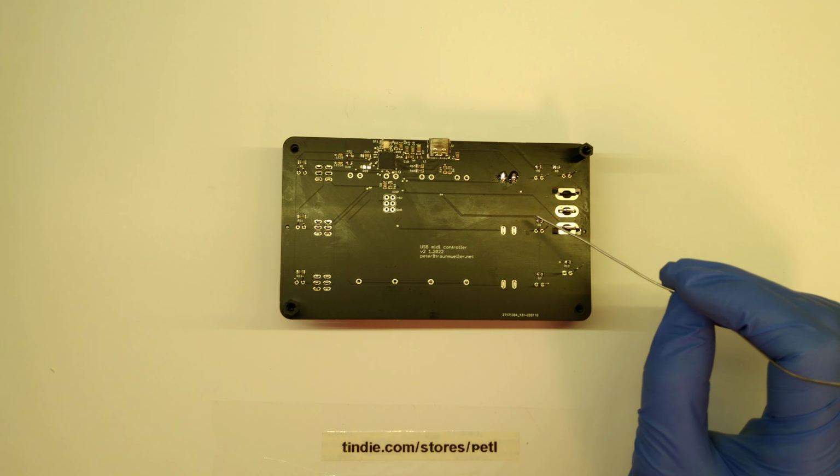These sliders are still a bit wobbly because they are not screwed on, and also the switches on the right hand side are just pushed in from the top. So let's start by putting the 3 nuts on the switches. They also don't need to be overly tight, because the acrylic glass on the one hand doesn't like mechanical pressure at all, so don't screw them on too tightly. And on the other hand, the switches are held in place anyway by being pressed between the PCB and the glass. So that's just for additional safety and stabilization.